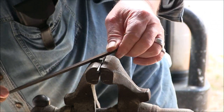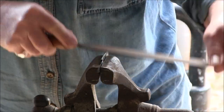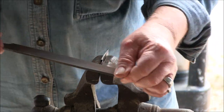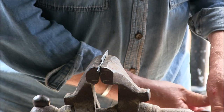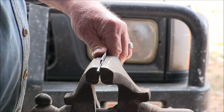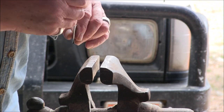The other way of doing it is to drill the center of the antler with a drill bit smaller than the size of your tang and push it in. Alternatively, if you can't do that, drill one the size of the tang and push it in, but then you'll have to pin it. I don't want to have to pin this one, but I can if I want to.